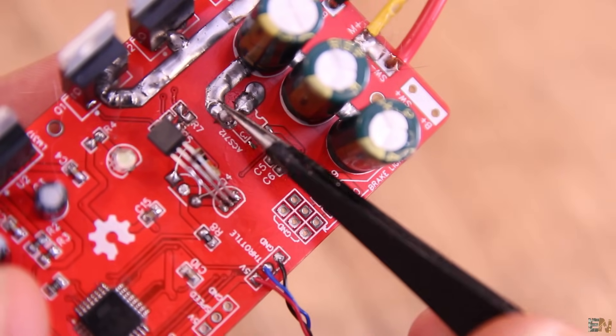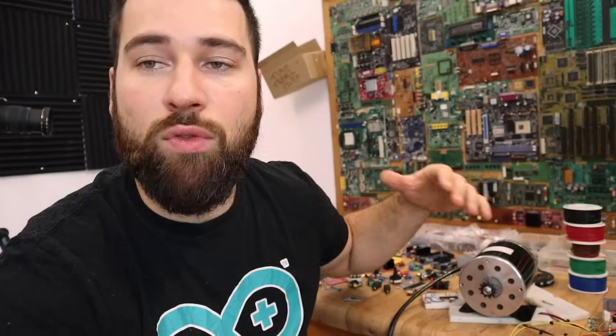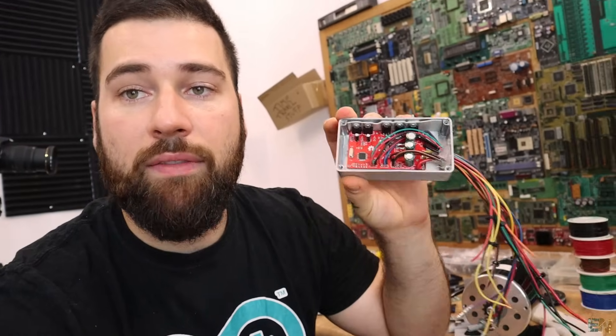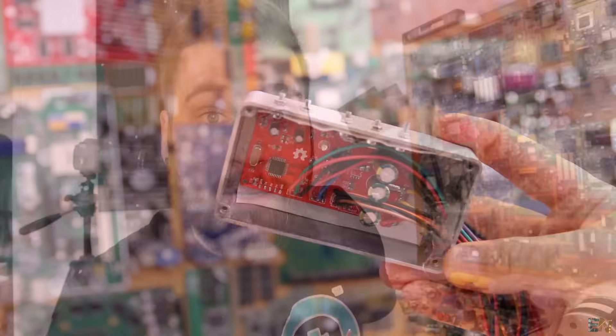I fixed that error and I also had a small short circuit. That chip was using the ACS712, which I was using to detect the current value and limit the current. If you want to limit the current to 10A, if you pass that value you can decrease the PWM signal to make sure that the MOSFETs and the motor will be safe. When I finished the PCB I used a small metal case, placing the MOSFETs there with some thermal paste in between so it will conduct all the heat, because without this case the MOSFETs will burn out in seconds. During some tests at 8 or 9 amps, in just 3 seconds without the heat dissipator the MOSFETs blew up.